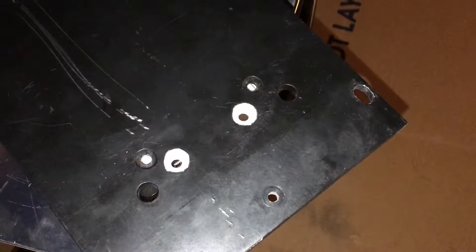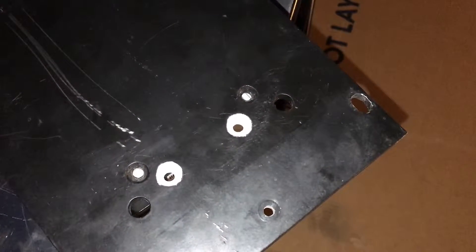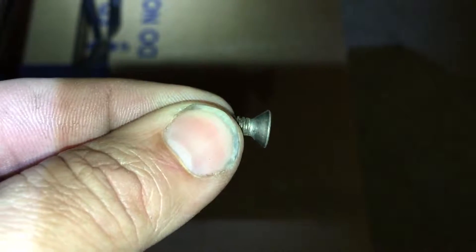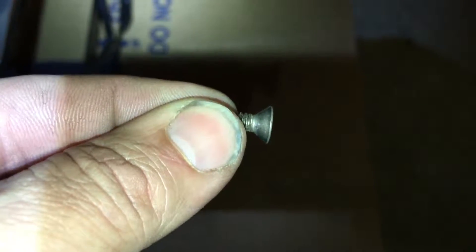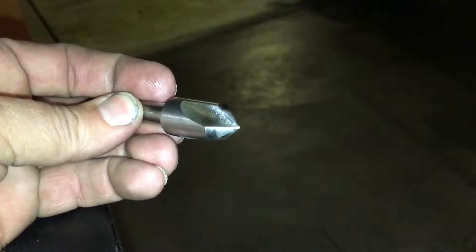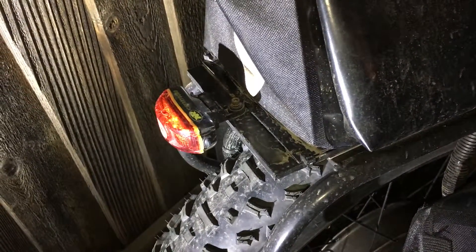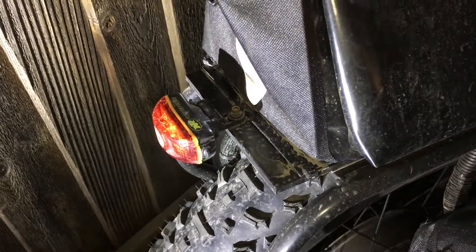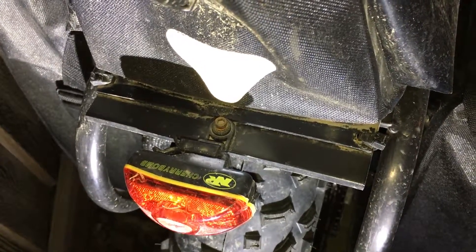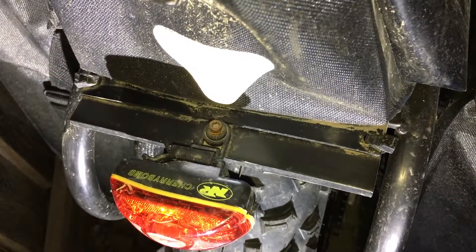I'll file it down and make it flat with some pliers. I also need to chamfer those holes because where the holes attach was getting in the way of the cross member. I chamfered those holes and have a conical screw — like this — that'll drop right into that chamfered hole. This is the type of bit you use for chamfering. I also need a hole for that flashing rear tail light, centered at the rear.